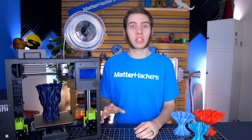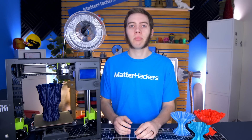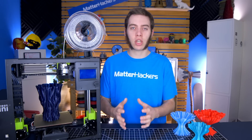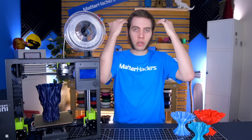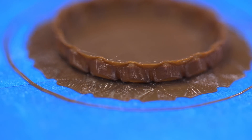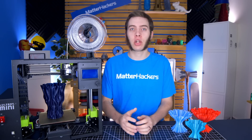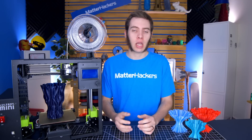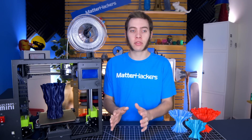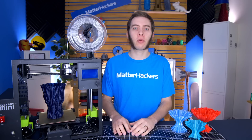Now, if all that still presents issues where your parts are warping away, consider adding a brim. That's something I tend to avoid — I try to solve the issue before getting to a brim — but there are specific scenarios where no matter what I do, it just refuses to stick and adding a brim doesn't hurt. Think of a top hat: the hat has the top, and then there's the flat brim around the crown. That's what a brim is — it gives you a larger base for your print to have as surface area to help keep it on the bed.